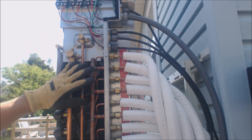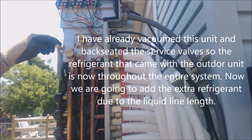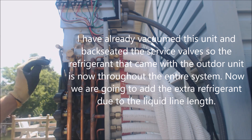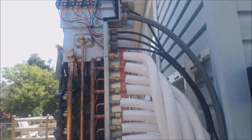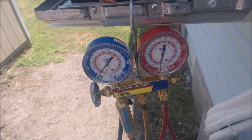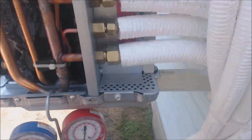In cooling mode, we're adding to the vapor line — the low pressure side. In heat pump mode this is your low side, the closest point to the side of the compressor, which is why there's a tag there. We can enter refrigerant right here, and there's also a fail-safe right behind it — an accumulator. Even though we're using a liquid vaporizer, there's an additional fail-safe. We have our 410A bottle down there.